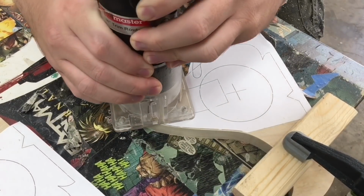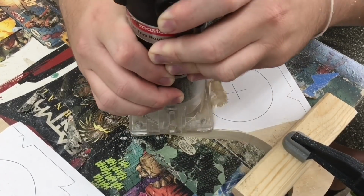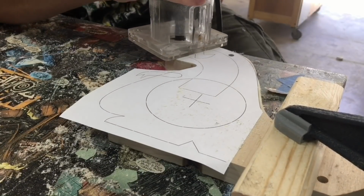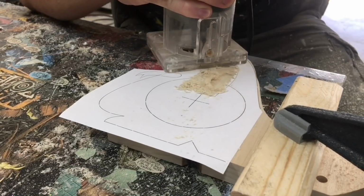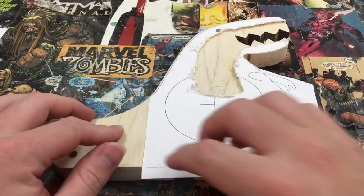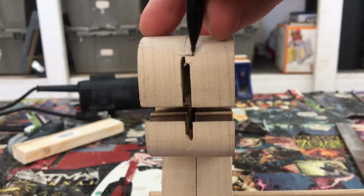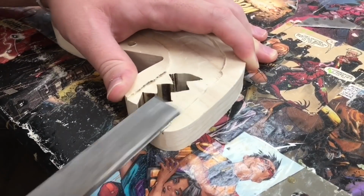I had originally planned on using my Dremel to route the coin slot, however when trying to set the depth on a test piece it kept shutting off on me, so I quickly switched over to a trim router. The route wasn't as clean as I would have liked, however this will be on the inside and will never be seen. This time around the template was removed much easier. The coin slot entrance was a little misaligned, but it was easy enough to clean it up with the file.